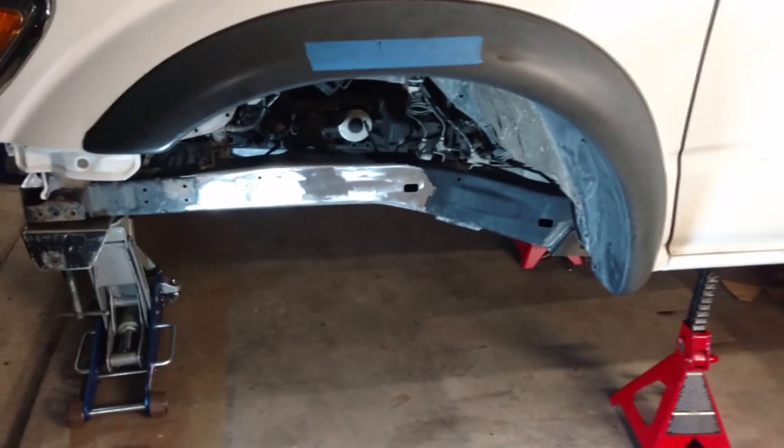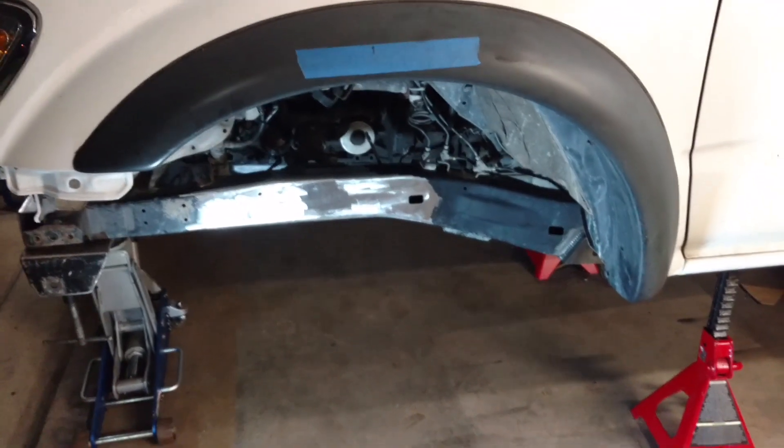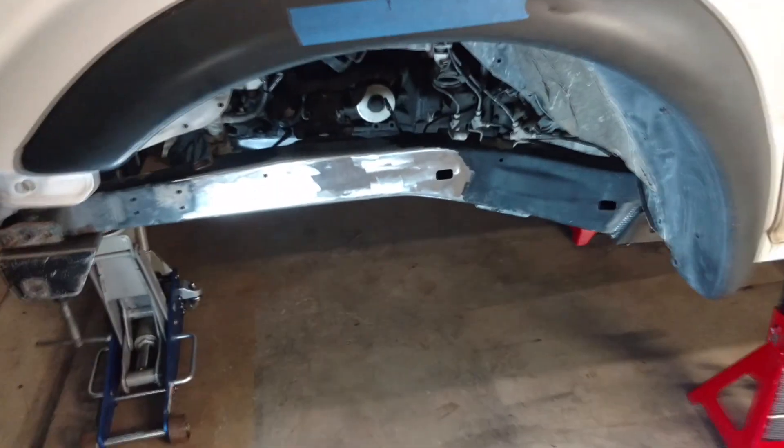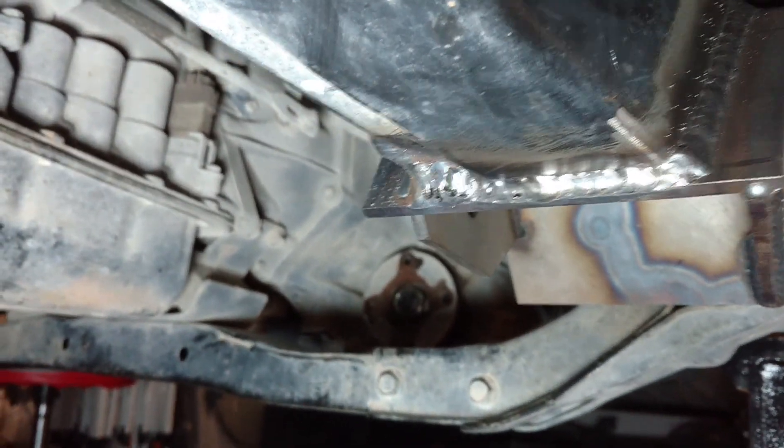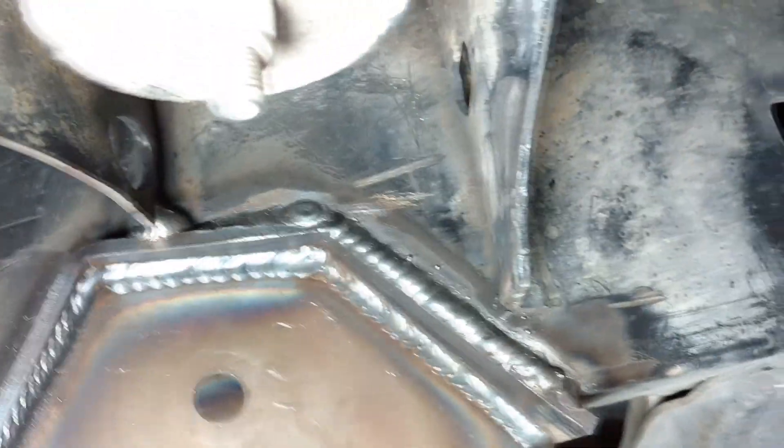It's almost 10 o'clock and I've probably been welding on this thing for close to two hours. I think it turned out okay. Some of the welds look really good, some look mediocre. This area looks really good — nice weld top and bottom. That black bit's just a little slag, no big deal. Stitched it together pretty good on the top edges. A little bit of undercutting here in the corner, but generally a pretty good weld. I'll show it all to you, because I'm a truthful guy.